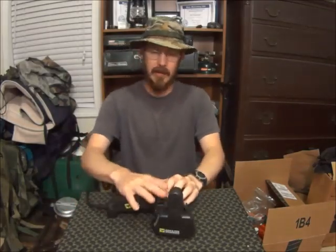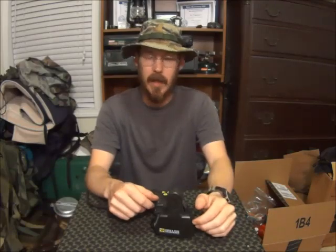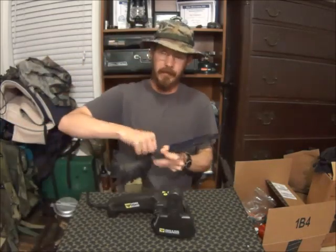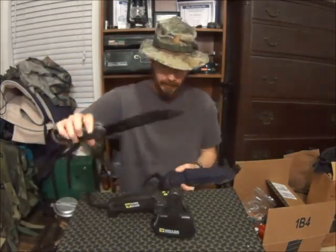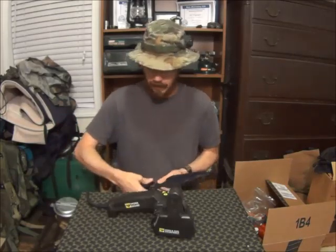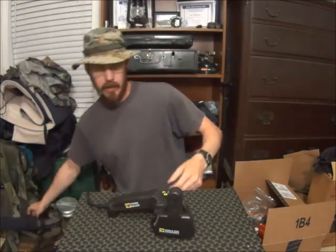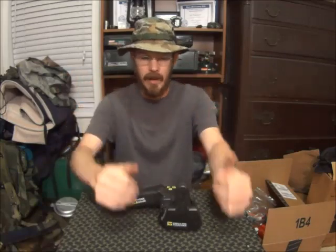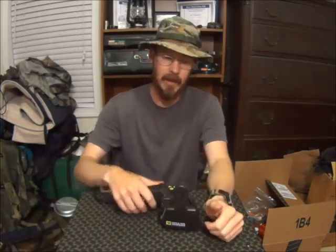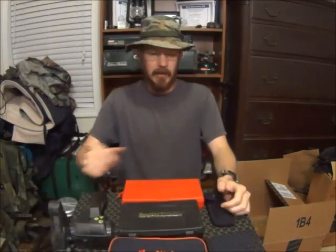So, again, I use this for things like, anything that's just going to take too long with any other method. Here's a good example. My Topps Anaconda. Sure, I can sharpen that with any method. It's got really good steel. But I usually sharpen it on here just because we've got such a long edge. Just saves so much time. And you get about the same result. Plus, for the Topps Anaconda, I'm going to do a lot of chopping with it, batoning, things like that. That convex edge is really going to help because you get that extra amount of strength from the shape of the edge. Alright guys, I'm going to go ahead and wrap this up.